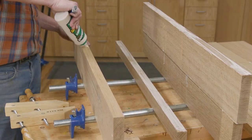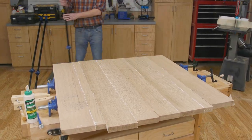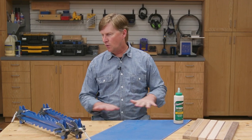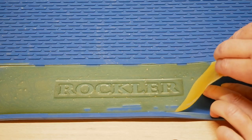These panel clamps reminded me of another benefit of this project: a cutting board is essentially a small panel. Once you understand how to make a cutting board, you can use the same process to make larger panels for things like tabletops, cabinet sides, or doors. For glue, since cutting boards get wet, you'll want a waterproof glue like Titebond III. Protect your work surface from glue squeeze out using plastic, cardboard, newspaper, or silicone project mats — I like the mats because dried glue peels right off.